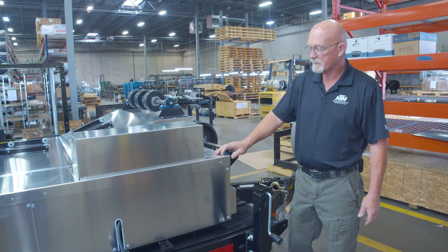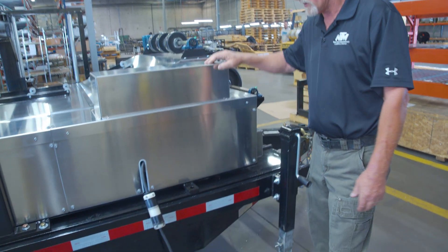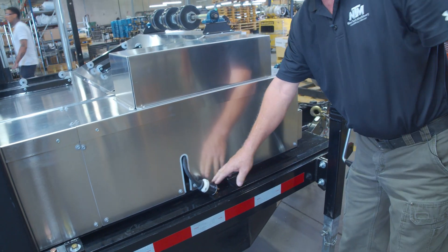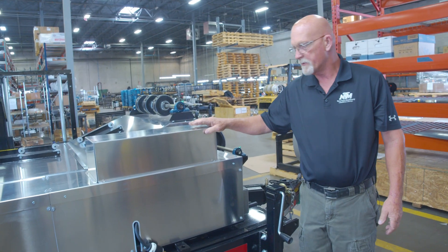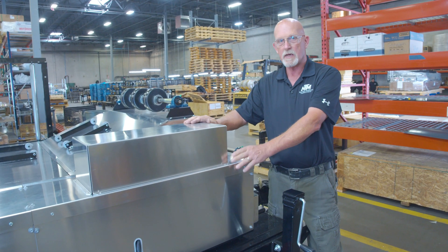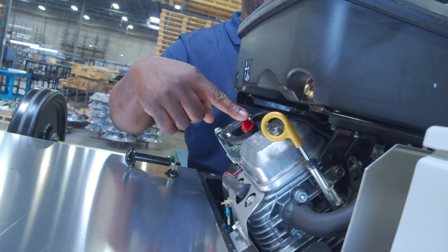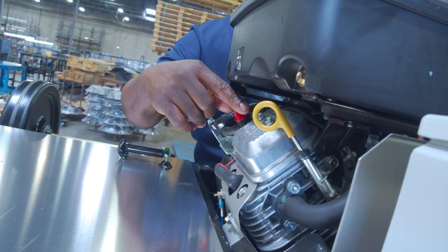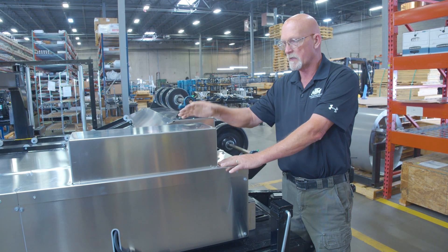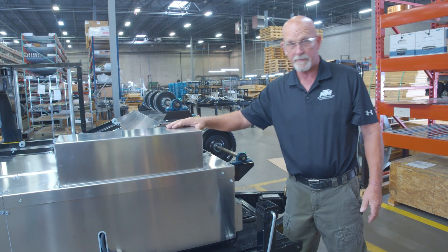Let's talk about the motors. When transporting, this has an electric motor on it — make sure your motor is unhooked and your cable is tucked away nicely. With a gas motor, if you're transporting, make sure you turn everything off, especially your gas. On the backside of that motor there's an on/off for the fuel. If you have it on during transport, there's a float in the carburetor that will flood the motor to where it won't run properly or you won't even get it started.